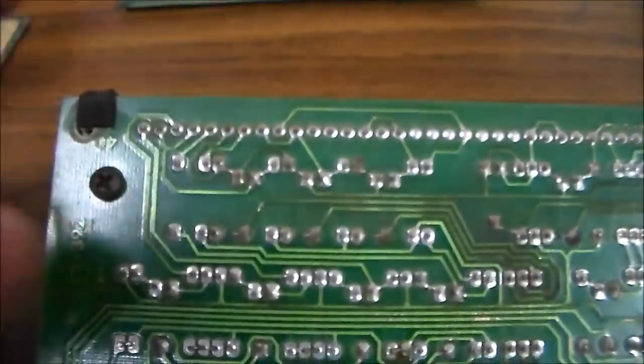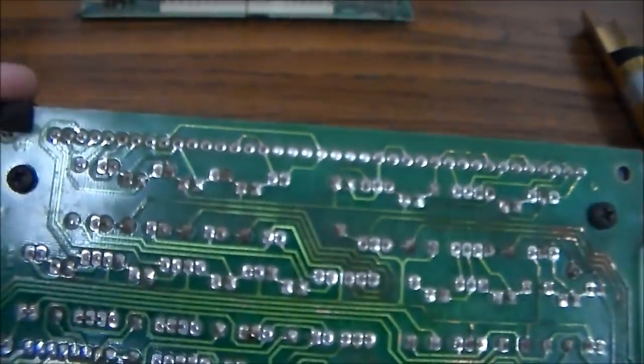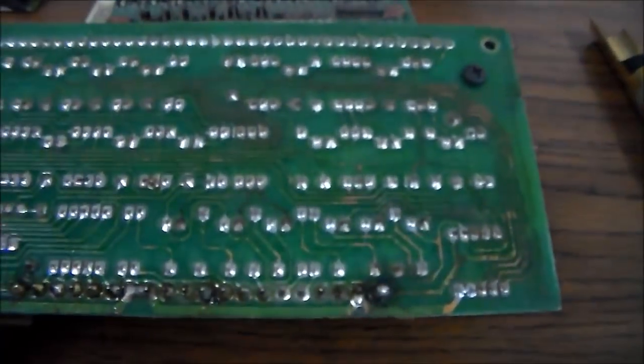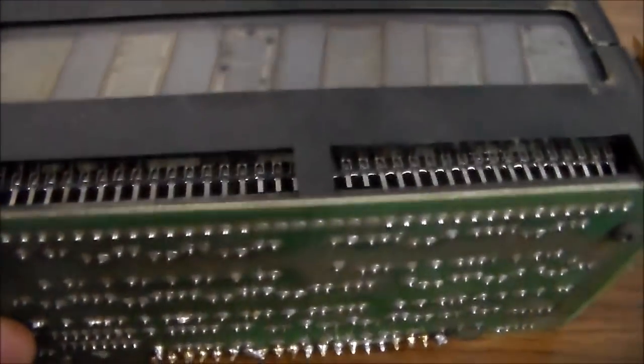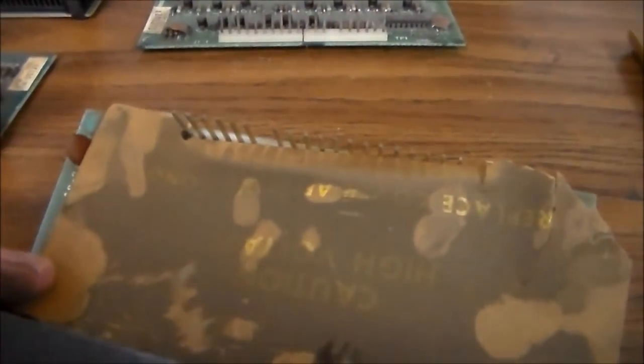It's kind of like how you get burn-in on your CRT in a video game, an arcade game. Basically, the only way to fix that is to replace this entire glass piece, which, as you can see, is soldered on with maybe 40 pins. So if you've got displays that have that on it, the only way to fix it is to replace the glass. The glass costs as much as a brand new display, so it's pretty much trash. You might want to hang on to it just to save it for parts, so you can fix some of your other ones with it.